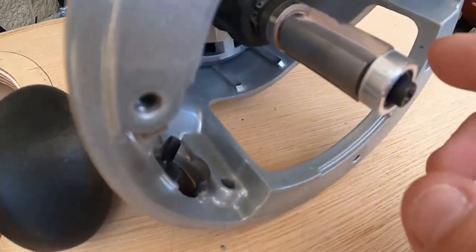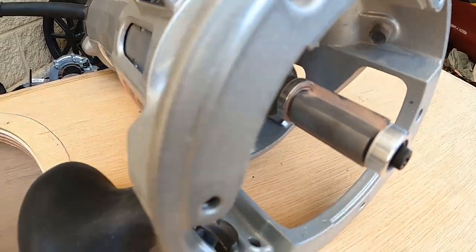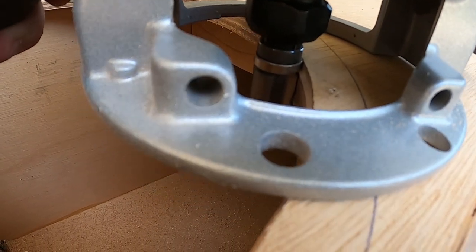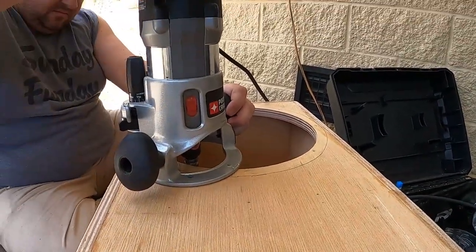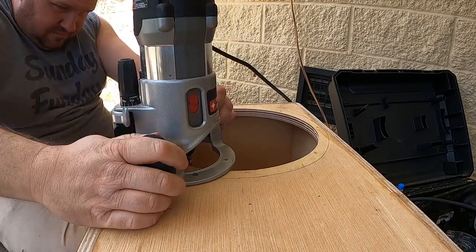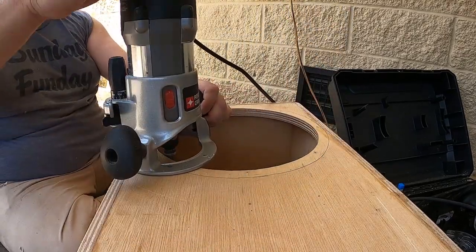So then, like I said, that's what this lined up all the way at the top, and then you're gonna put it down to this next bearing and it's gonna flush trim all of that. Alright, let's try that. So we got it lined up on the top route out. Now let's give it a pass. And there we go — smooth as a baby's bottom.